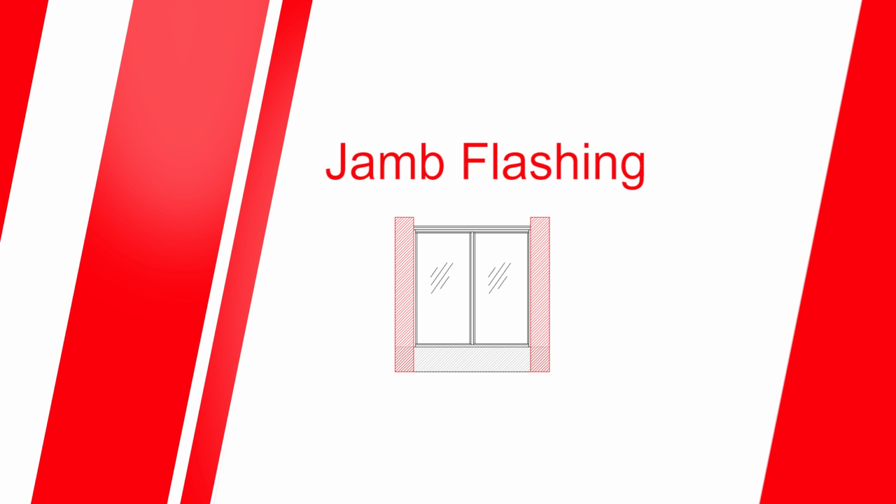Flashing and weatherproofing of the opening is probably the most important part of the installation process, and is particularly important in high wind and exposed locations. The sill flashing is fitted to the bottom of the window and extends on either side at least 150 millimetres. The jamb flashing should be at least 150 millimetres wide and attached to both sides of the window, starting 150 millimetres above the window and continues down to overlap the sill flashing.